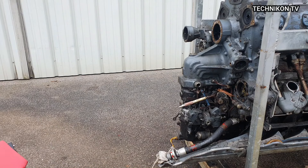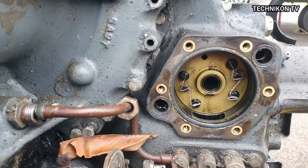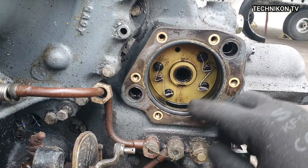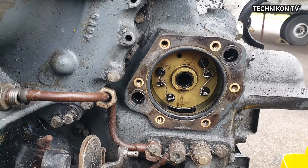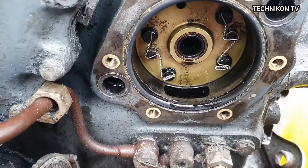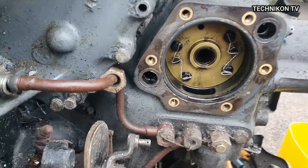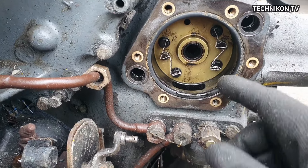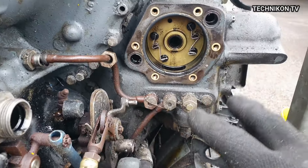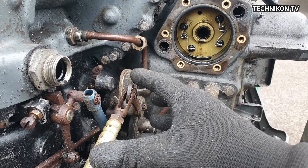So let's inspect the housing. As you can see, this is the engine driven oil pump and this is the pad. You can see there's an O-ring there because there's oil all around. As I said, you can see the filter inside — you've got the inlet filter and outlet filter. Both filters are there just to trap the debris and filter the oil before it goes back to the engine. That is the driving pad, and that's where the pump is fitted.